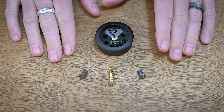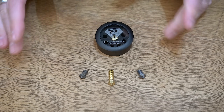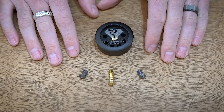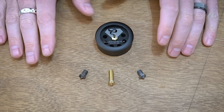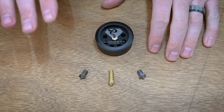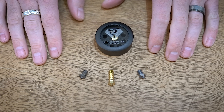First up, why hardened nozzles? Why don't you just use a standard brass nozzle? Well, there are a lot of different types of filaments out there and not all of them work perfectly with a brass nozzle because they can be abrasive. There are a lot of abrasive filaments out there — you might be looking at a marble filament, wood fill filament, or specifically carbon fiber or fiberglass filaments.